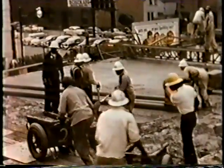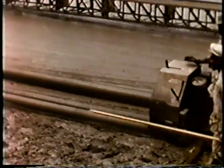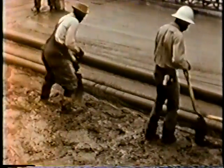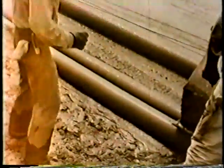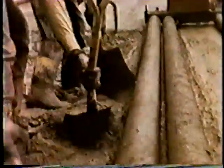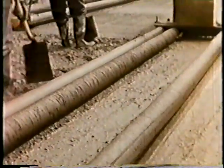There were over one million square feet of deck in the two contracts. Two machines were used in order to finish the full four-lane width. Strike-off and tamping was kept right up to placing — concrete was fresh and workable, and surpluses and shortages were easily taken care of near the point of placing and vibrating. These machines have a positive action in striking off, leaving the surface true to grade, resulting in a great saving of labor on subsequent floating operations. The tamping action, caused by eccentric mounting of the front roller, leaves approximately one quarter inch of rich, full-bodied grout for easy finishing.